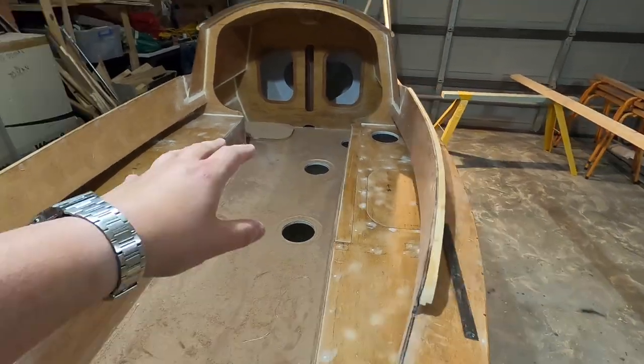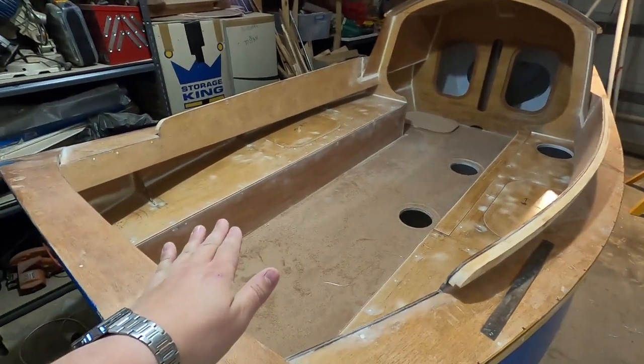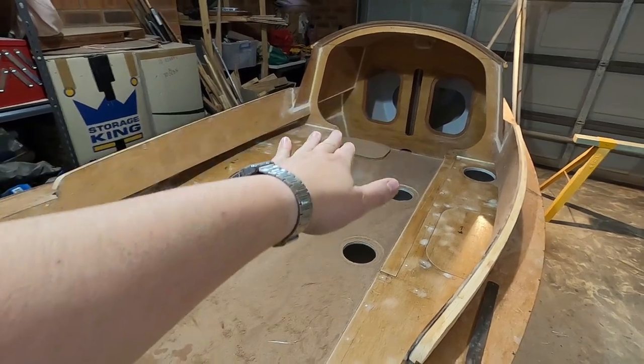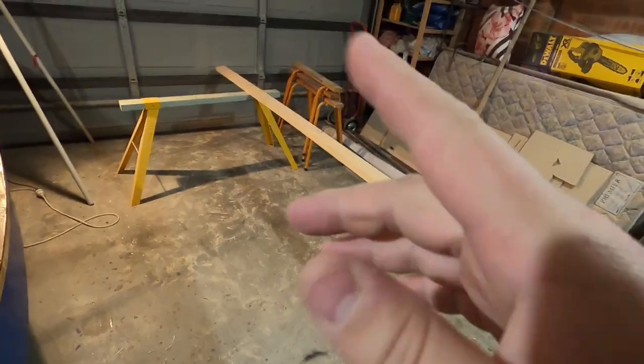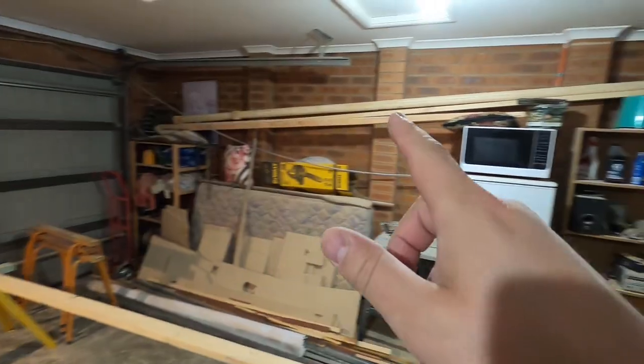You can sit on while you're rowing, and potentially I'm also going to use it to create a little floor here so that when I go camping in the boat, I can sort of lay some planks down and have this entire space where a mattress can go. So I don't have any cleatstock left, but I do have these two big long planks here that I was going to use for the boom and the yard. So I'm going to rip some 20x30mm out of them, and they'll do their duty.